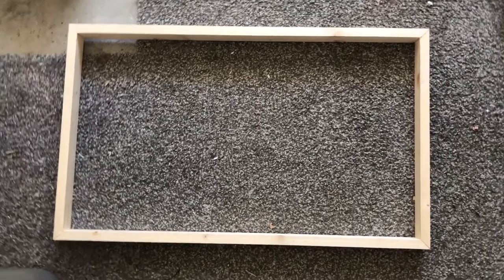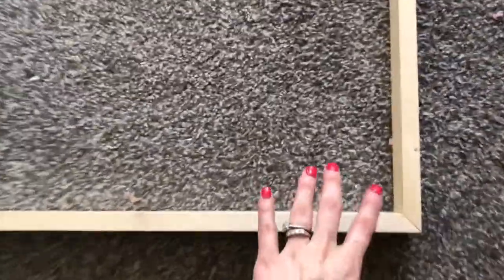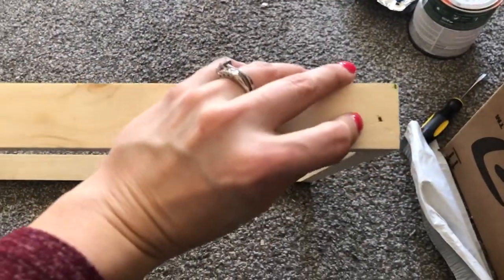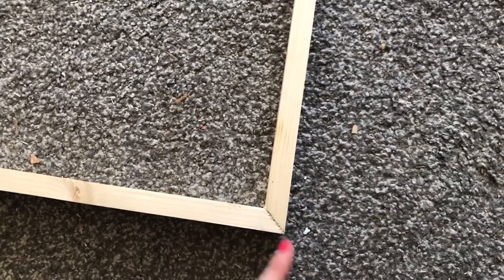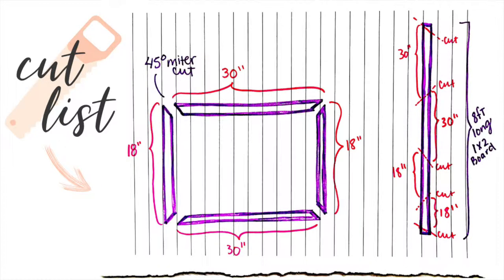You don't need a power tool. You just line them up and you can use a stapler — staple across and secure the corners — along with some wood glue. Or what I did was use my finish nailer and nail straight into the corner, so there are nails going into the side down into this board, which keeps it nice and secure. I'll also put the measurements for these boards in the full blog post. It's basically 30 inches from the long part of the cut, and 18 inches for the shorter sides — the inside cut is shorter.